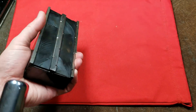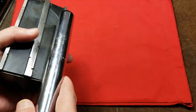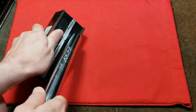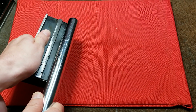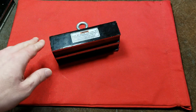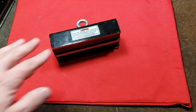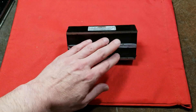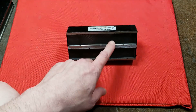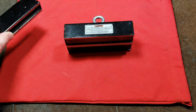Something that's a little different is this center bar and this magnet — it doesn't really want to go on the center bar. But what is surprising is that even on the side bars, it really feels quite a bit stronger. Even just on the edge, it's actually significantly stronger. So the design of this really is delivering more effective magnetism, and to tell you the truth, I'd probably get this one over the 150 pounders unless you really need the narrow magnet. This one just seems to really perform much better, even on the same size of materials.